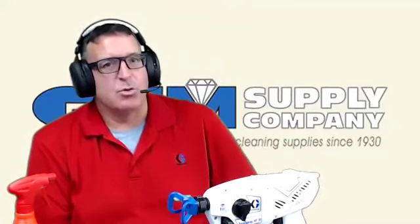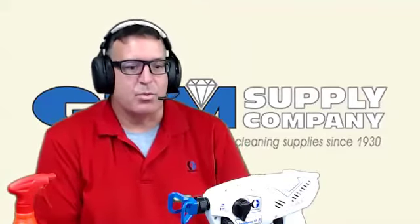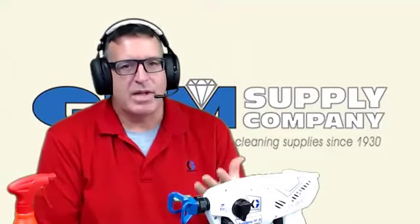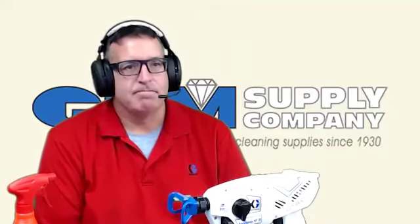So it's basically a fine, a medium, and a coarse. I've got the one that says 313 on it now. And I kind of personally prefer that one just because it gives you a little more control. But if you do want to go faster and need a wider fan pattern, you can go with these other nozzles as well, and it'll speed up productivity, even though this one's pretty productive with a smaller tip in it. But I would start with that smaller one, the 313, and then you could always go up from there.